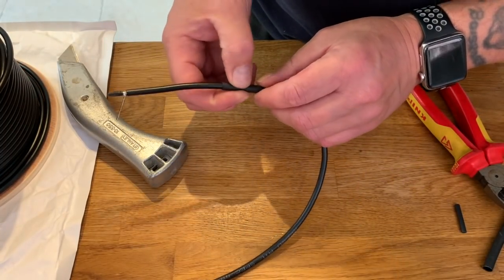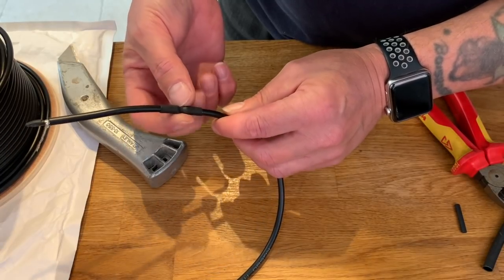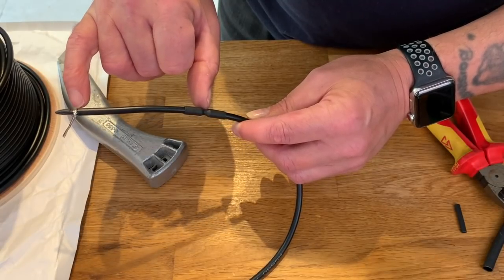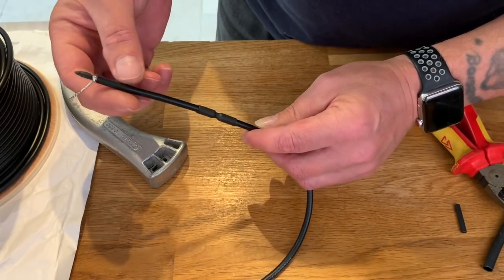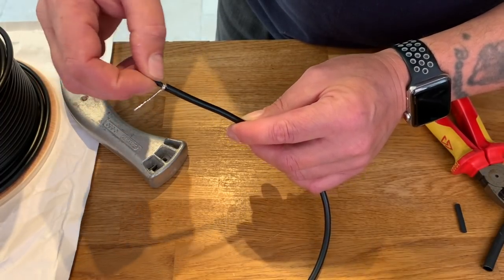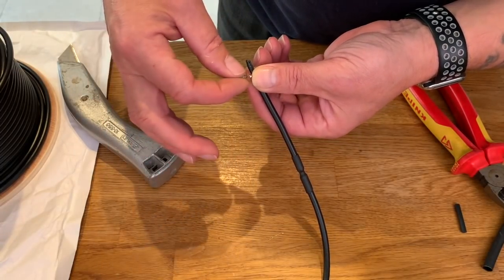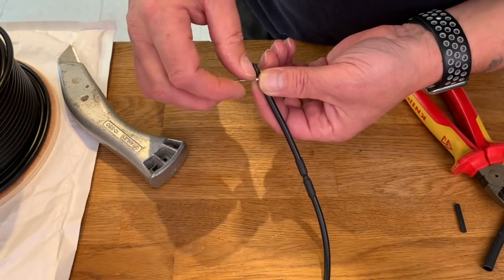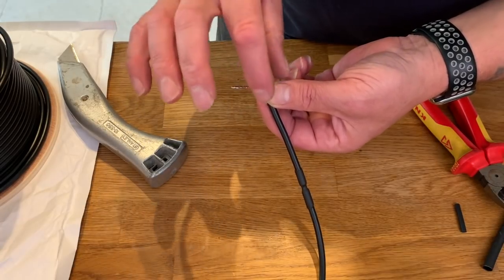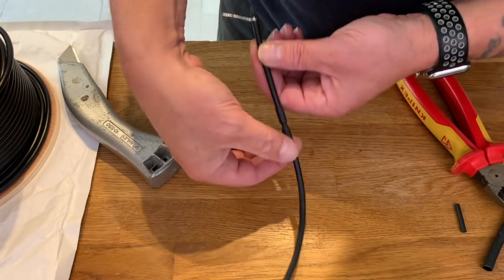What we have here is coax. Outer shield is cut at this point, about a 5 to 6 millimeter gap, and then the continuation of the coax with the outer shield for 86 millimeters or 8.6 centimeters, and then the outer shield is taken away from the center core, the center dielectric. That's isolated. I've just put a bit of heat shrink on the top, and this is the outer shield. So what I'm going to do now is connect the driven element to this bit. I should bend it up first, and then once it's soldered on, I'll wrap it with some insulation tape, or perhaps use another piece of heat shrink, probably the glue lined again, and that will be our capacitor and driven element connected to our coax.